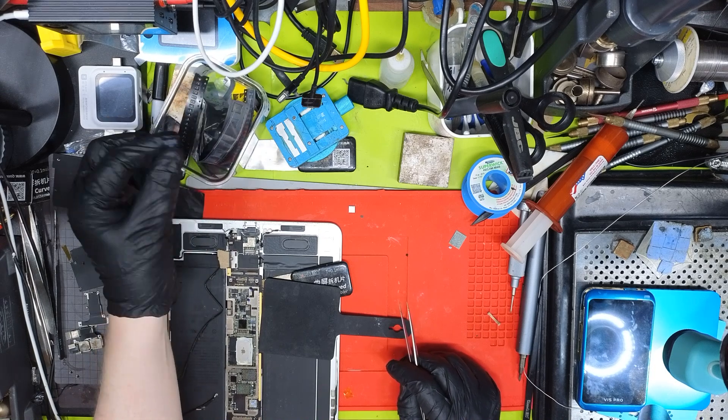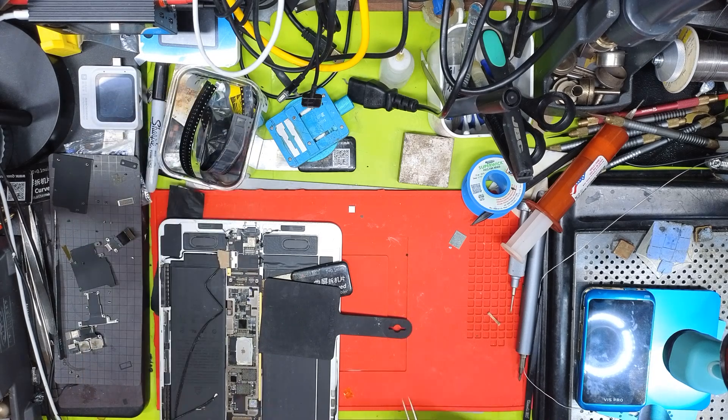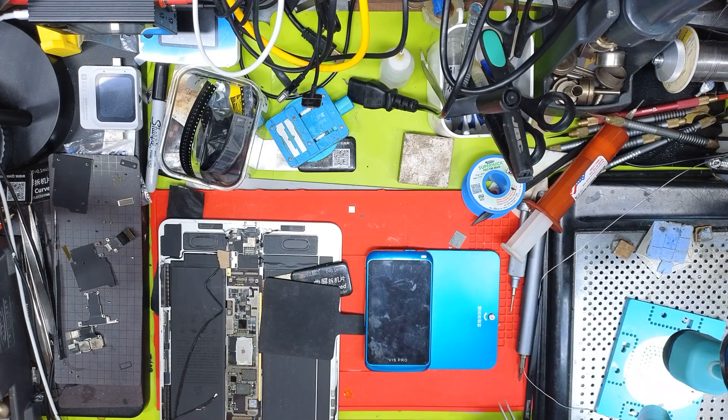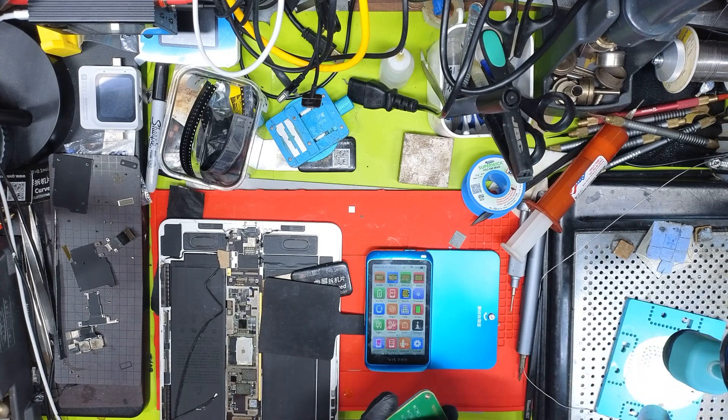These two chips are actually not paired. What happens is when the CD32 chip burns out, it burns out the ROM IC, and the ROM IC contains the data for the chip. So it has to be programmed using this programmer. You'll also need this adapter.